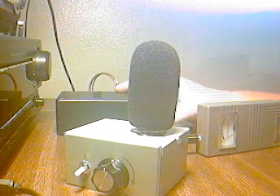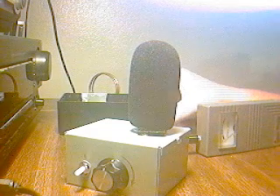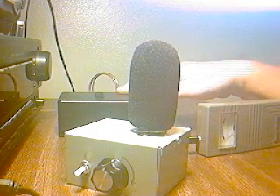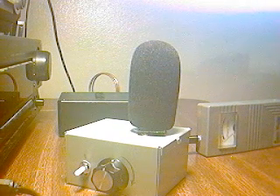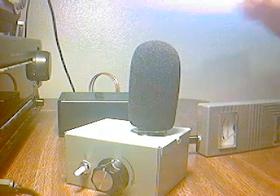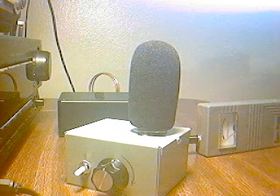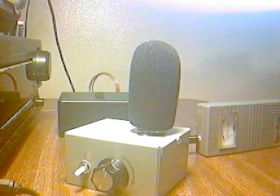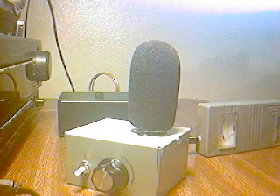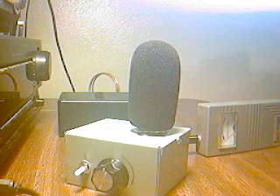This is the power supply back here, which is basically just some batteries out of a laptop power supply that I use to power up the microphone. Any 7 to 35 volt source of DC power will power this microphone. It must absolutely be powered by batteries and not by AC or an AC-connected power supply to keep the hum level down. It's very sensitive to hum since hum is 60 cycles and down near the infrasonic frequencies.